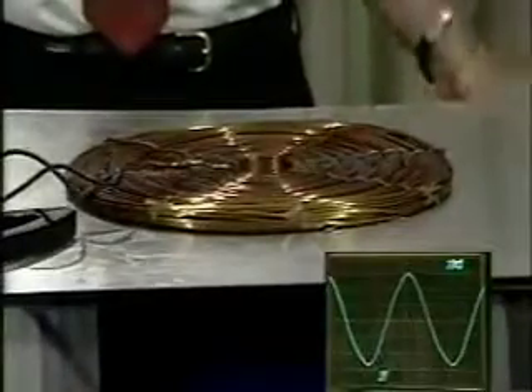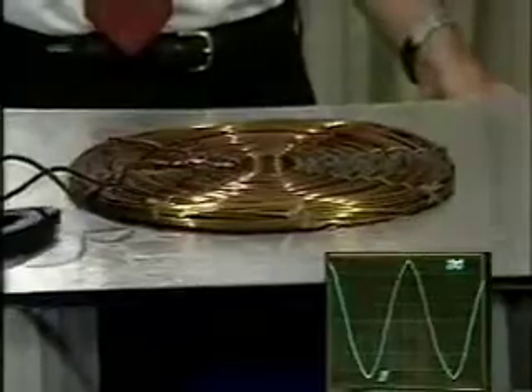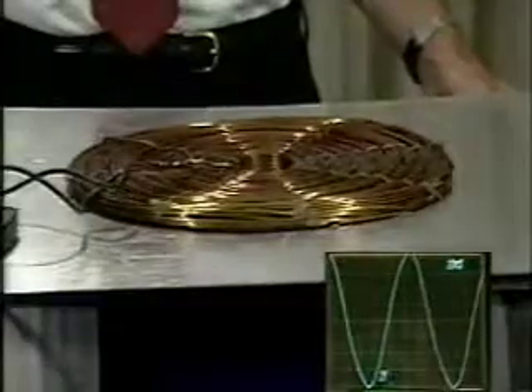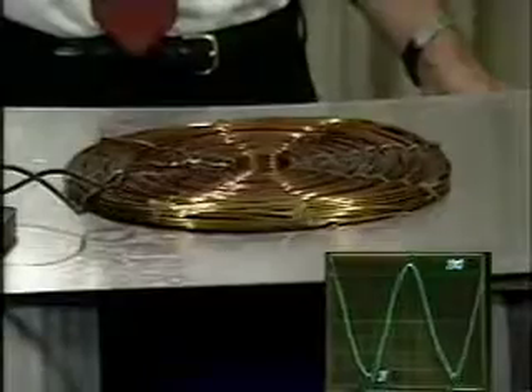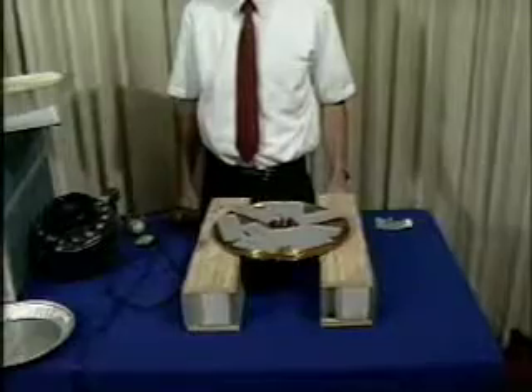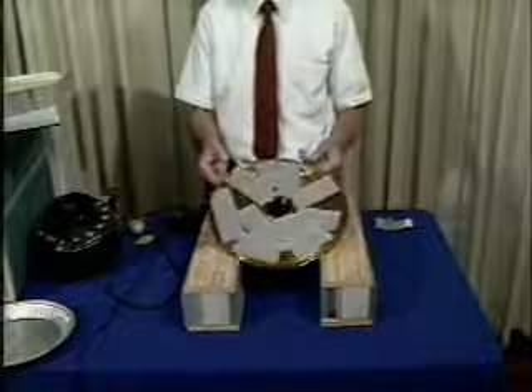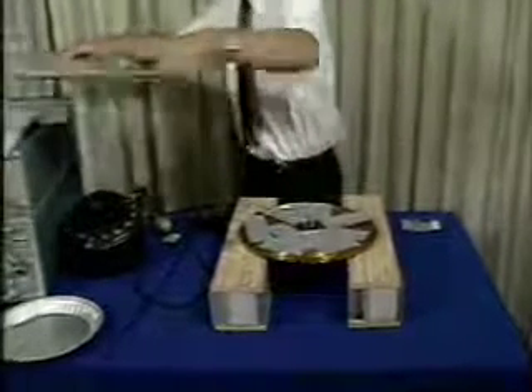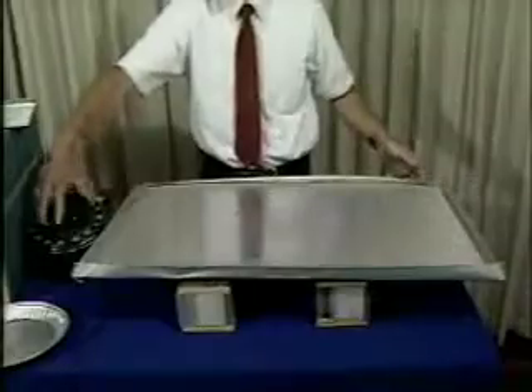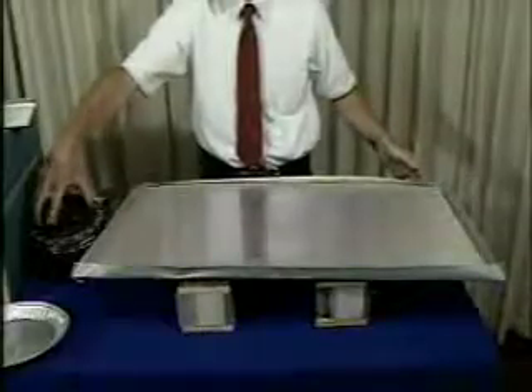Here it is again with a current of 30 to 40 amperes. The coil doesn't lift off, but the induced current does make the ground plane very hot. Our coil has the makings of a burner for a stove — our thin sheet could be the bottom of a pan. Our experiment has been turned upside down. The protective border prevents spillage. Let's turn the current up and let it heat for a while.